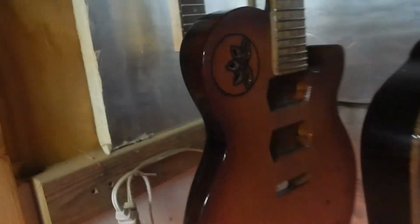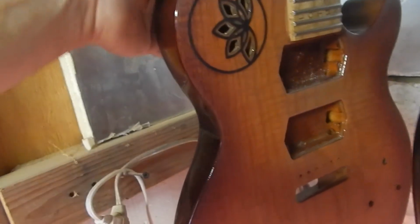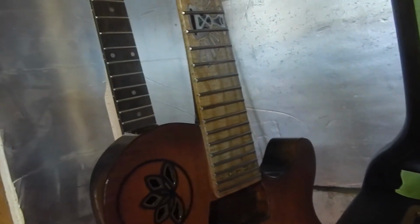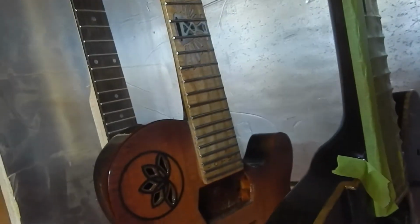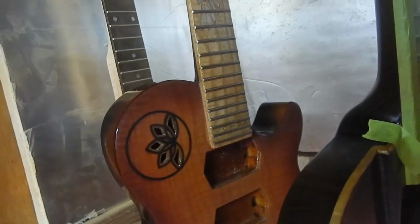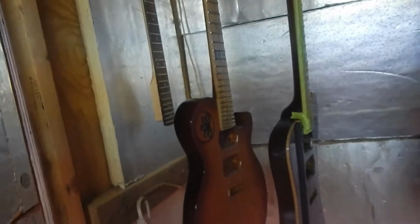And it was a lot of pain to go and find a piece of wood that was suitable. It took, I don't know, 5 years of drying time to make sure the wood was cured enough for it to be sprayed like that. Otherwise, if the wood isn't dry, you can't really make a one-piece guitar. It's going to move around. It's going to be messed up. So they've got to be down to like 6% dryness.